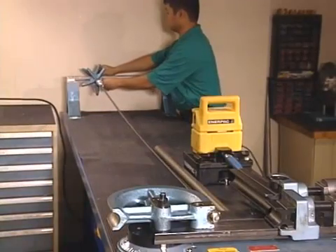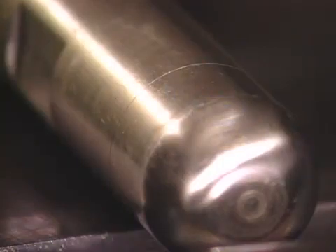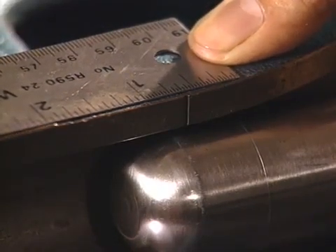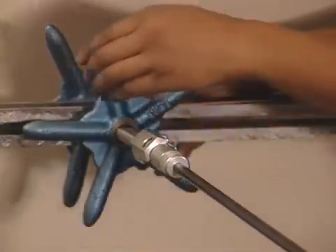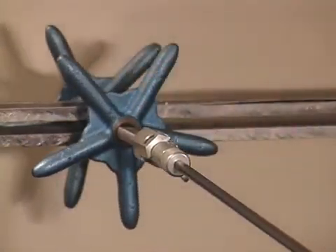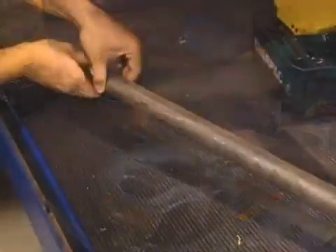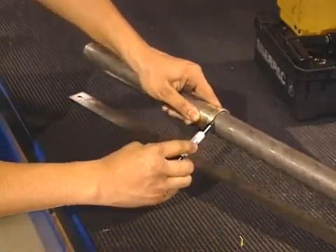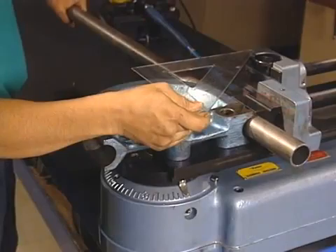The stop screw should be centered to the dimension on the scale that corresponds to the bend radius. Notice the scribed line on the circumference of the mandrel. For average bending, turn the rod stop handles at the rear of the bend to adjust the mandrel so its line is 5/8 of an inch behind the zero-degree mark on the radius block. Turning the lock nuts on the mandrel rod stop assembly makes the adjustment. Next, lubricate the mandrel with light lubricating oil, then slip the tube over the mandrel. You'll then follow the same steps as non-mandrel bending: marking your tube, selecting the slide and clamp block grooves, rapid positioning, positioning and clamping the tube, using the tie bar, and setting the bend angle.